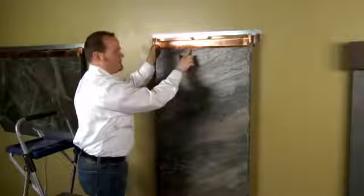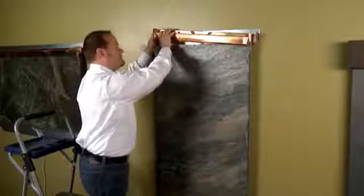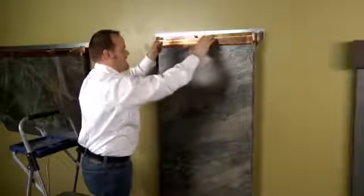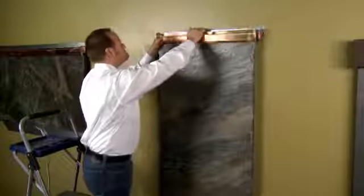And you can see how we filled in some of the gap, but we also have more gap over here. And so you may need to do this a few times, but really push this in. Don't be afraid that you're going to break the water distribution unit, because that's why we made it out of this copper, because it is pliable. And so as we've seen before, we just want to fit that right back on, and we still see that there's some gaps going on. And we'll just keep adjusting it until we can get that gap filled in.